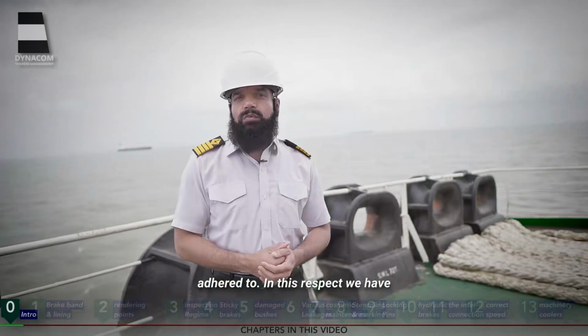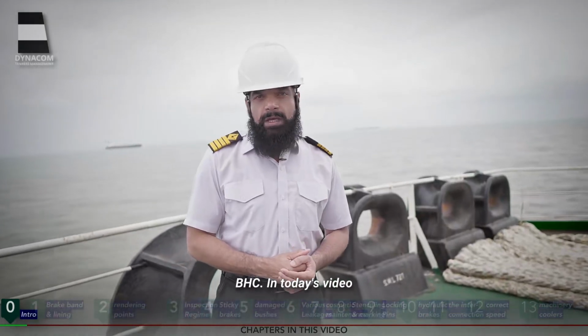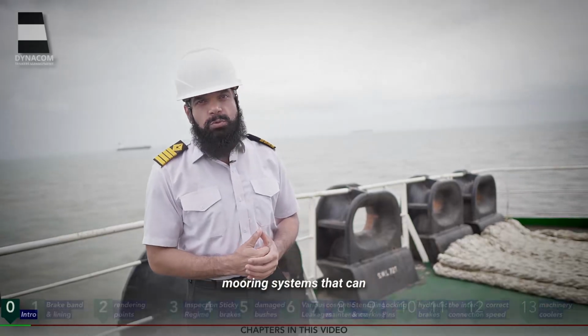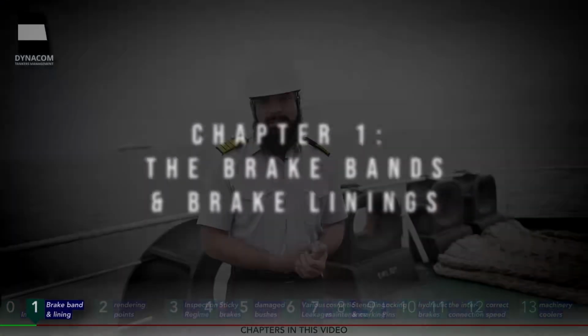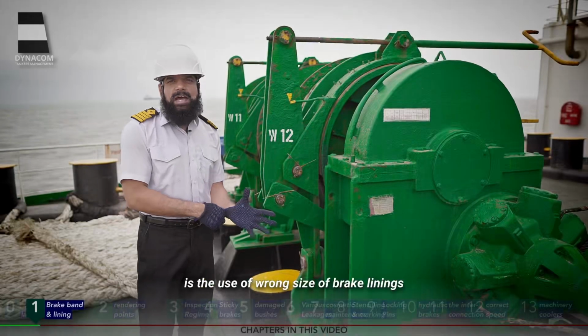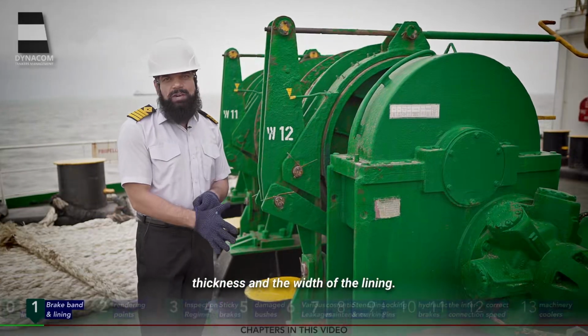In this respect, we have already made a video about the correct procedure of testing BHC. In today's video, our main focus would be the common observations noted on vessels' mooring systems that can and may lead to the objection on a vessel's mooring systems by third parties, ports and terminals. A common observation noted is the use of wrong size of brake linings on winches and windlasses. This includes both the thickness and the width of the lining.